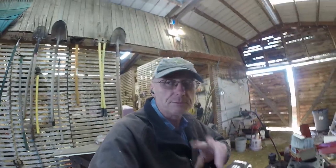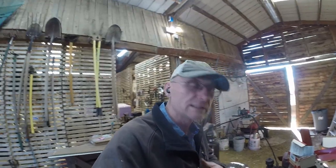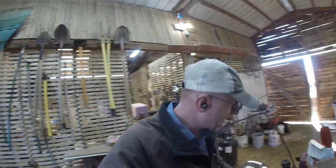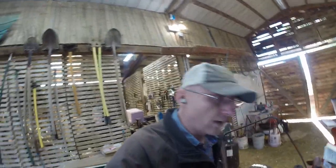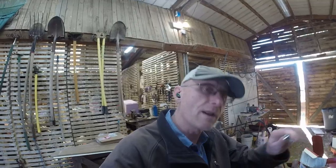I'm excited about this because this is set number 3. I went with another vendor and they sent me the wrong set twice. They sent me 3.725 rings and this is a 3.625 motor. I was almost thinking about putting it back. Well, I wouldn't have done that. I would not have put the rings back in as is and just run with it.